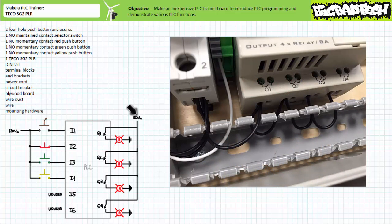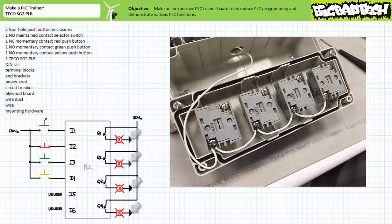Let's start by wiring the line output of the circuit breaker to the one terminal of each electromechanical relay output. The black wire serves this purpose. Note the daisy chain connection pools the one terminal of each relay output such that the closure of any particular output relay contact would energize only that particular relay's output with 120 volts AC. Let's prep our output by pooling the low side X2 connection of each pilot lamp with a neutral connection. The white daisy chained wire serves this purpose.